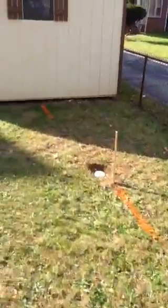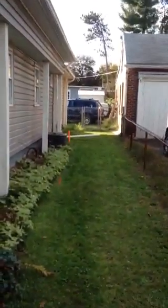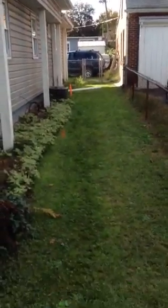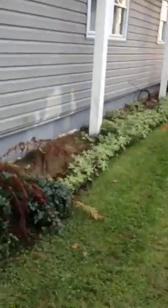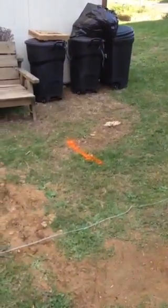We can pull under the shed, and we can start the pull from under the shed to under the shed — we'll have to dig this spot up. Then we can pull from this spot the whole way back to that orange stake by the AC unit. It's roughly about a hundred feet overall — we're probably going to be pulling about 75 feet of it and digging about 25 feet. It's not real deep right here, only about four and a half feet. Past this clean out, the second belly out here, it's probably five and a half to six feet deep.